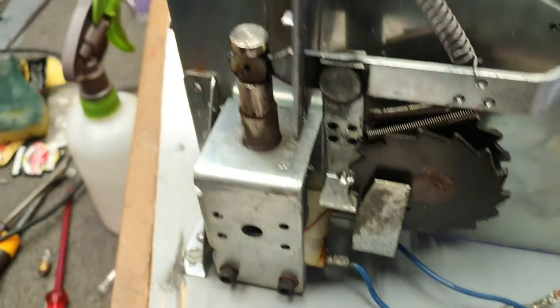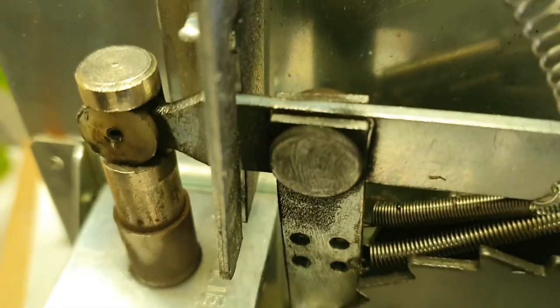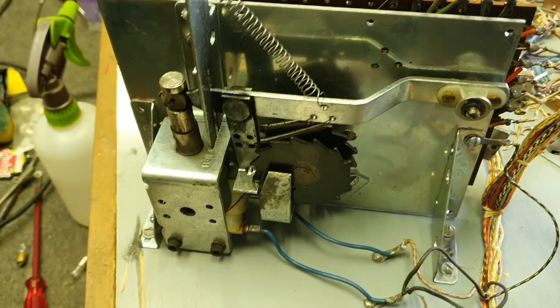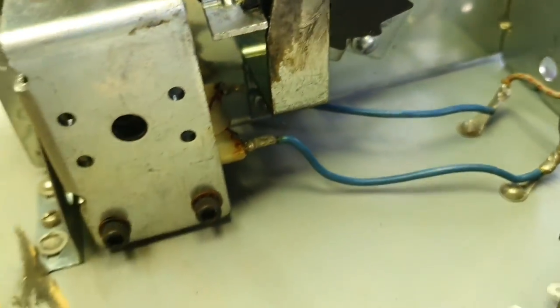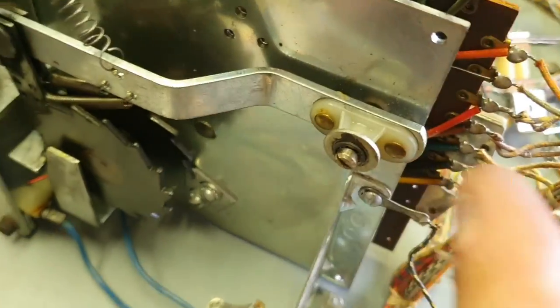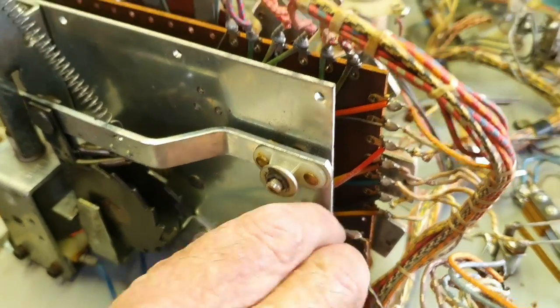That's what we're here for, I guess. Look at the coil plunger — it's all grungy and dirty. We'll have to replace the coil sleeve. The pivot point on the pawls is bad. So out this will come out of the machine, and we'll clean it all up in the ultrasonic cleaner, and we'll show you the results. The first thing we're going to have to do — we'll dismantle that here, and we'll desolder from these points here. So we've desoldered these wires here. Now all we have to do is remove the earth strap, and as always, don't forget to put those back on. It's very important. If you don't put it back on, things won't work.